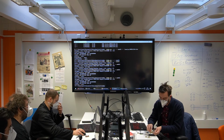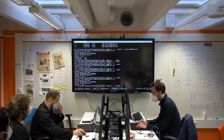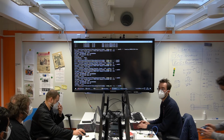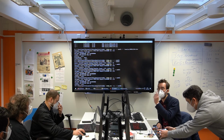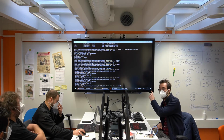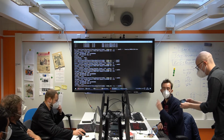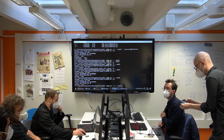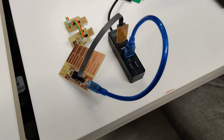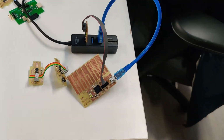It's connected, and this time it's the 21, which is really my favorite flavor of chip, because, I told you the D11C has 16K of flash. The D21 has 128K of flash. And there's an 18 variant that has 256K of flash. So this is getting quite significant. They cost a few euros each, but still really worth it.